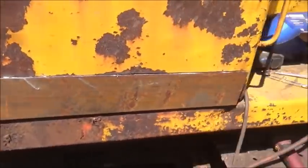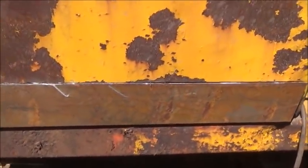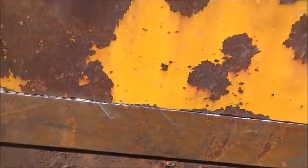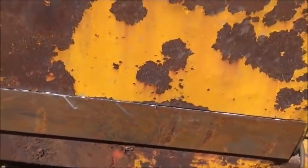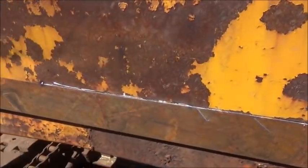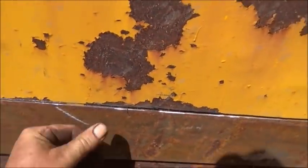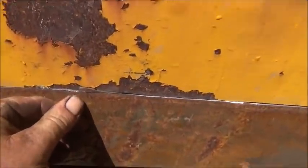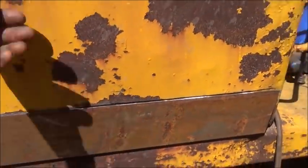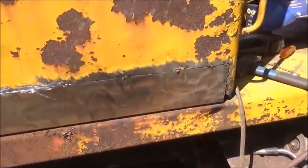We've got it up there, starting to cut it out. You can see how I cut it — just cut up close to it and try not to mess up. Doesn't look like I've done the best job in the world, but we can weld it up. Just gonna keep going until we get it set in there and tacked in place. I can push it in in particular places until it's level and then go ahead and tack it, because I can take that extra piece out from the back side.